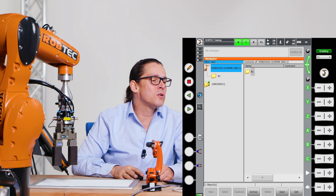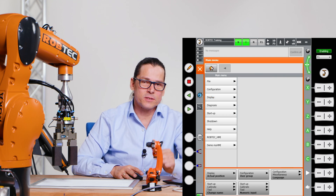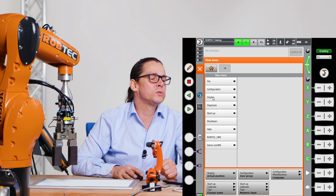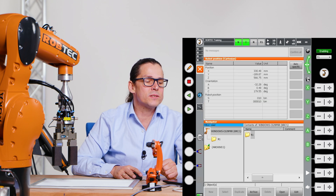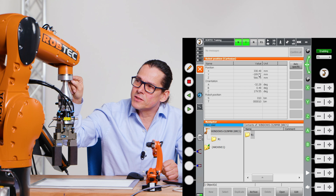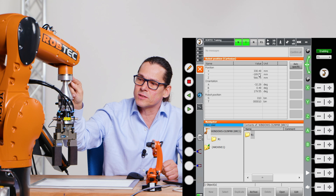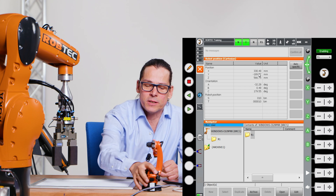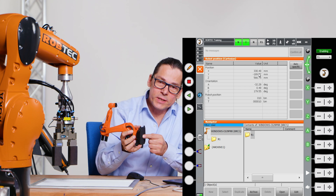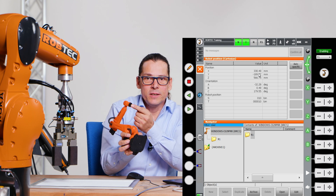For that, on a KUKA robot I go to the KUKA sign, which opens the main menu. I go into the house — this is the first level of the main menu. I go to Display and Actual Position. Now, when I select the world coordinates here, I see the difference between axis six zero — in the middle of axis six — and the world coordinate system. I'll explain the difference between here zero, zero, zero, the world coordinate system, and here, axis six.